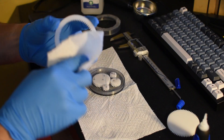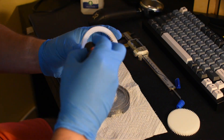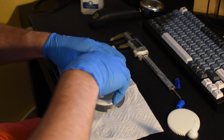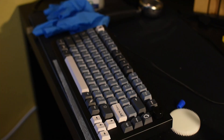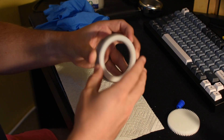Lastly, the ring gear needed to be glued onto the bottom housing. Each surface was prepped using sandpaper and wiped down with isopropyl alcohol. A thin layer of super glue was applied to the ring gear and then pressed onto the bottom housing. Weight was applied to the joint and left to dry. Now that the two pieces are adhered, the two halves were assembled, revealing the final product.